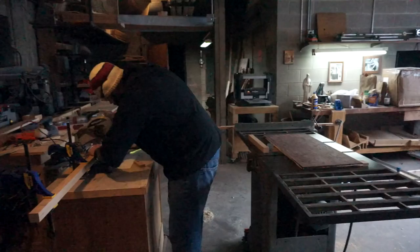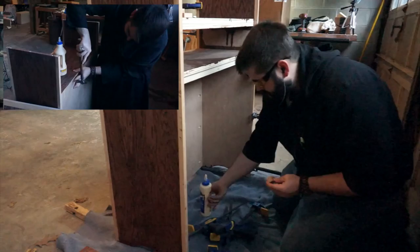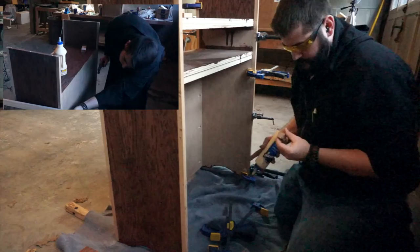Once I have all the pieces together, all I had to do is add a little bit of glue and then clamp it on up. Because there are no doors or internal shelves, there's not any place for the back panel to be securely attached to, so the way I'm getting around it is simply cutting up some small blocks, gluing them in place, and then tacking the quarter-inch plywood to the back of it, which should provide plenty of stability for the cabinet.